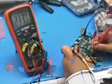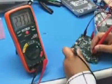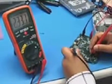The frequency function can be used to check electronic circuits up to 10 MHz. The capacitance function is especially useful for checking motor starting capacitors. A defective capacitor can lead to motor burnout, so it's always a good idea to check these devices when servicing appliances such as air conditioners.